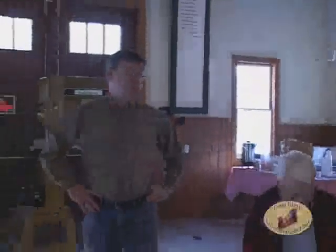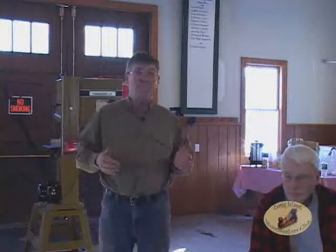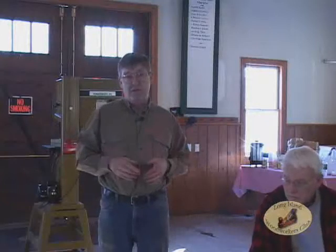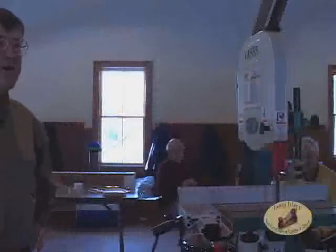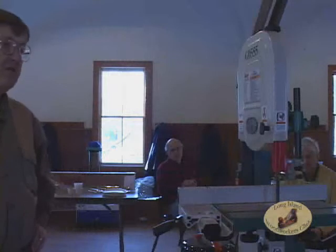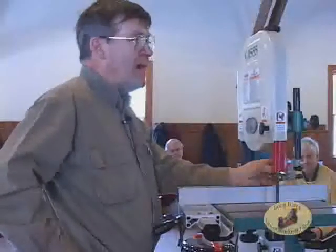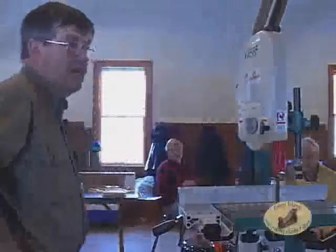There's a general feeling that three-wheel bandsaws are bad, but I think that's mostly because most three-wheel bandsaws were very cheap affairs sold at home centers. On the other hand, the Inca bandsaw is a big three-wheel saw, one of the finest you can buy — very accurate and finely made. The nice part about its bearings is that if they freeze up you can go buy a replacement for a small cost. After ten years of use in my shop, we had to completely rebuild the guides — the top and bottom guide seized within a week of each other — and we just went and grabbed a new set of bearings. No big thing.